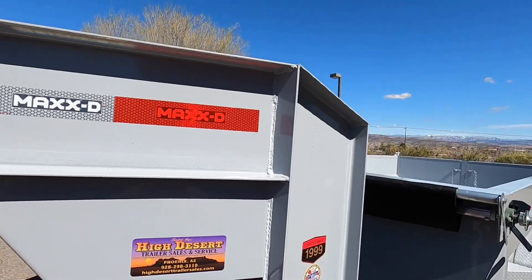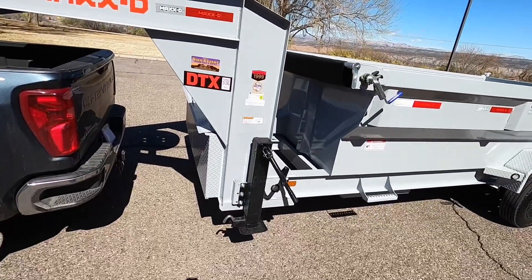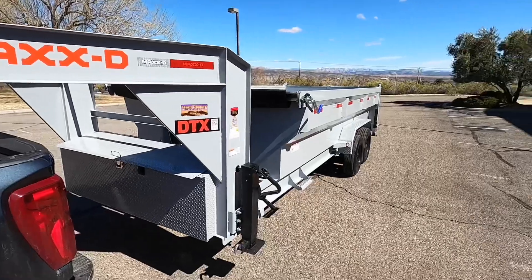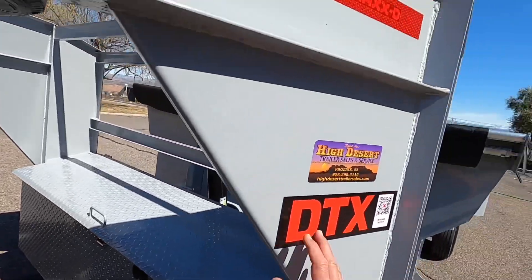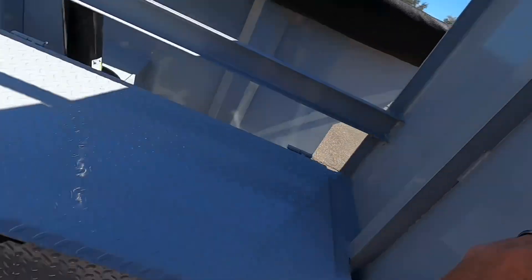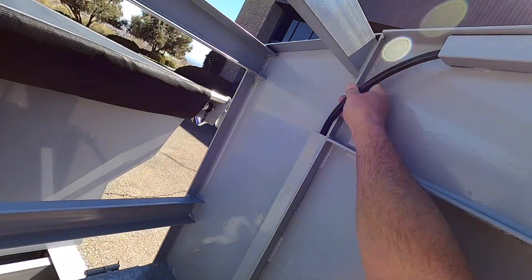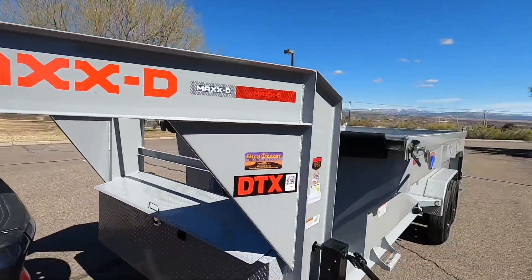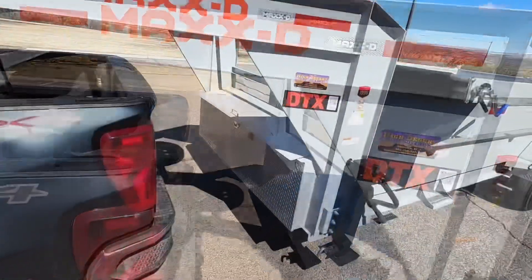I believe this is a 10-inch I-beam tongue. The way they built this is very stout, and the welds — I've looked it over pretty closely. I've heard a lot of other YouTube videos where people complain about weld quality on different trailer brands, but these look beautiful. They did a nice job. The supports built in here are quarter-inch steel plates, nice and stout. The wiring cable is all contained underneath, and I've got my spare tire mounted up above — a full-size wheel and tire, 16-ply.